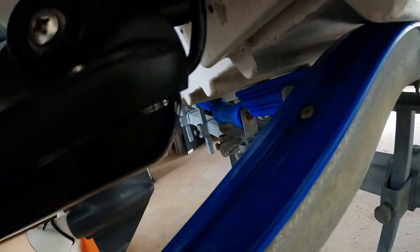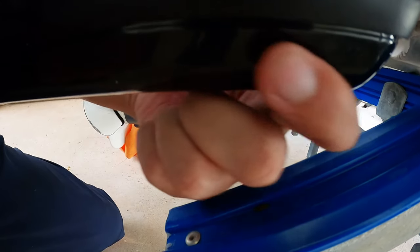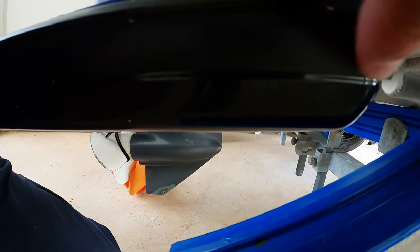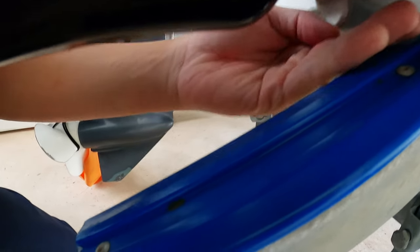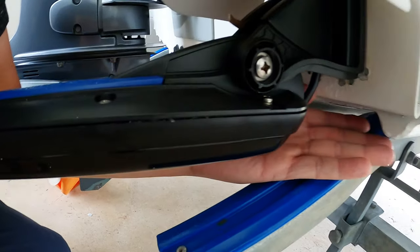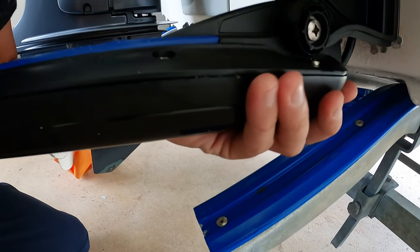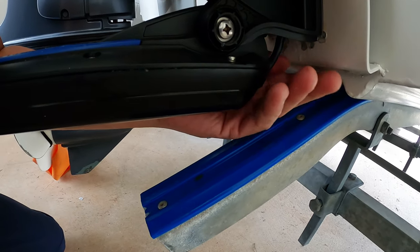From this angle you can see it's just slightly lower. This here is where the transducer is with a smooth edge, up here is just the bracket. The top of this smoothness is about two centimeters below the bottom of the boat - it's a little bit exposed. If you hit something or go over a big log, you might hit this, but it does kick up. So be careful if you have to mount your transducer a little bit lower - try to avoid big logs if you can.